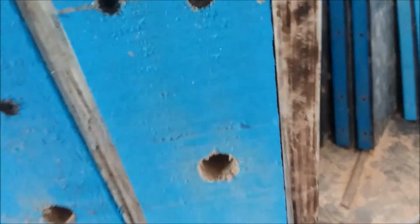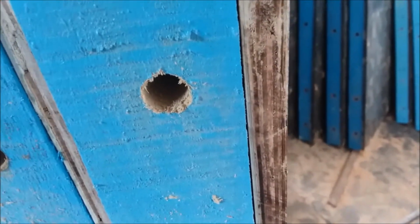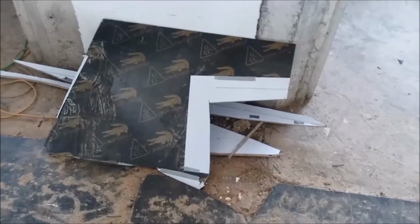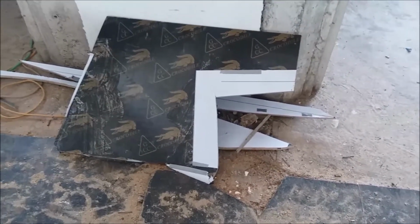I think this plywood has a lot of layers in it. Yeah, you can see that this is about the same kind of plywood. The only difference is, if you cut this, you'll let it run through concrete. Any voids in plywood here, they tend to fill with concrete. Now, this is crocodile phenolic board, and we've not run across concrete inside of it. But we use another brand.